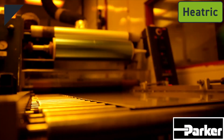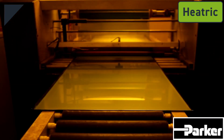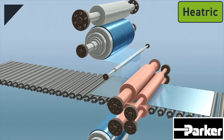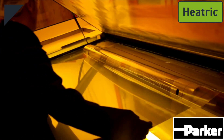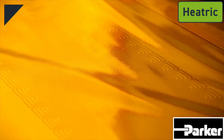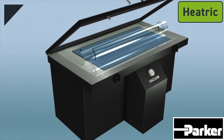Once cleaned, the 2 millimeter sheets are coated with a photosensitive polymer. During this lamination process, it is important that contact between the metal and the layer of photo resist is uninterrupted, so an impeccably clean environment is essential. The CAD-designed film work, or photo tool, which bears the design pattern to be etched, is then placed on top of the sheet and exposed to a burst of ultraviolet light whilst under vacuum.